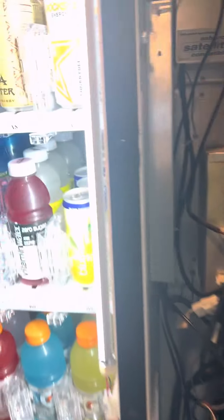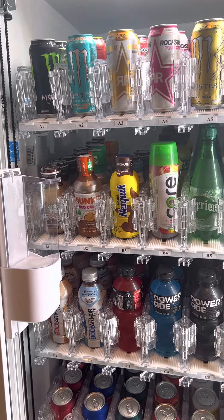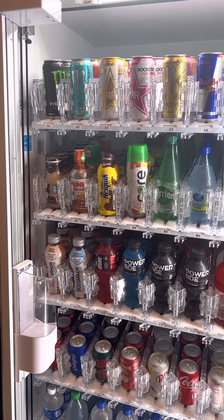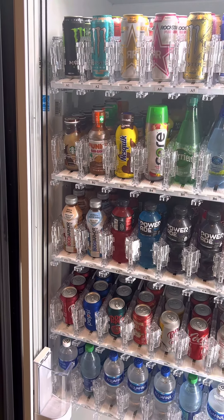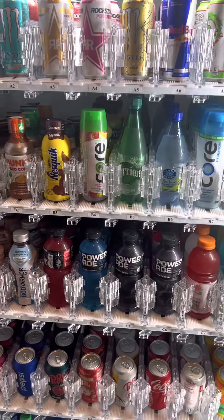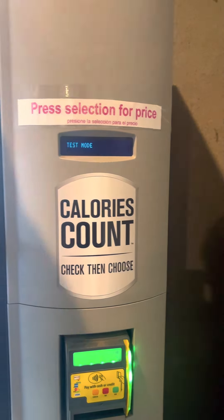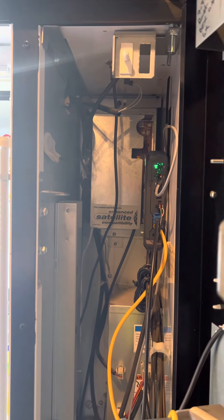So what I'll do is go into this position test. I'll run it up and down and I can see the switch lights go off and come on. Every time I say go home, I want to make sure they come on and stay on — solid once it's home. That's only when you're in this position test programming mode. Two presses brings you to test mode, then F-star and number one is position test — that's where you can see those lights. Normally for testing you wouldn't see those.